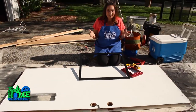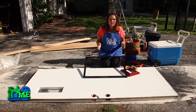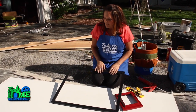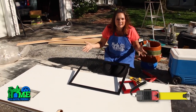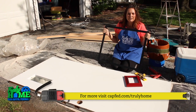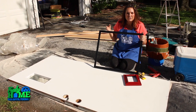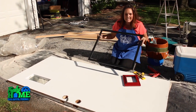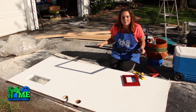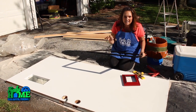To say that Sarah's front door is lackluster would be an understatement — this door needs help. We've taken it off the hinges and laid it out so we can see what we need to do to it. This door is boring. One way you can add some interest is by taking decorative molding. You can buy long pieces of molding at the hardware store and cut those, but here's an easy tip: take open-back frames that are the size you need and liquid nail them on. Then you don't even need a saw, so there's no excuse for having an ugly door.